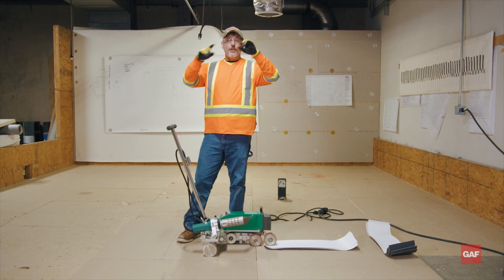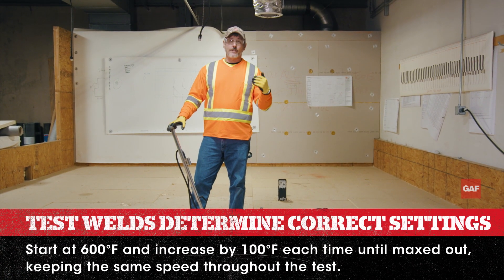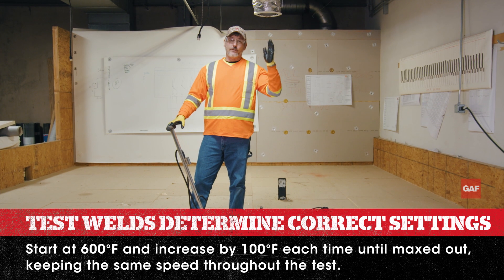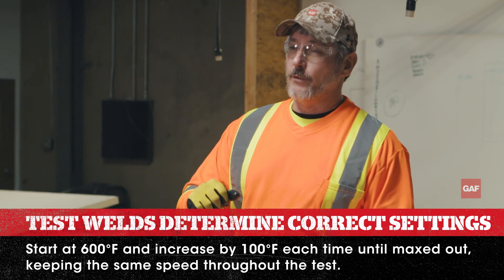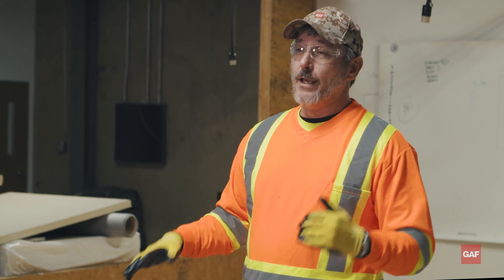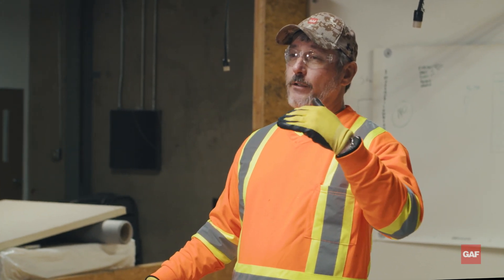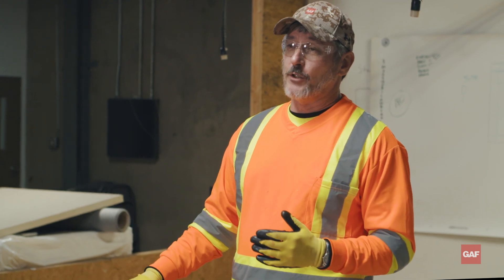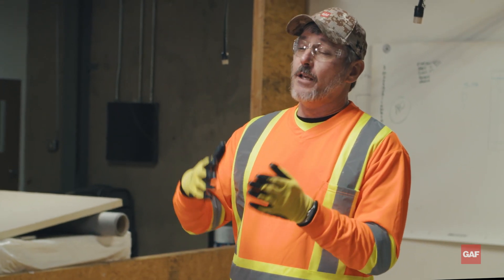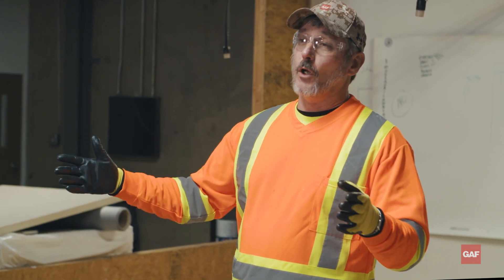I'm not saying you've got to stay there, but you have to have a baseline. In this test weld, we're going to start at 10 feet a minute and 600 degrees, and I'm going to do a weld. Once I complete that weld, I'm going to bump it up 100 degrees at a time — go to 700 degrees without adjusting my speed — and keep doing this until I max this machine out at 1,148 degrees. Then we'll go back and do some test cuts to find the bottom and top of our weld window.